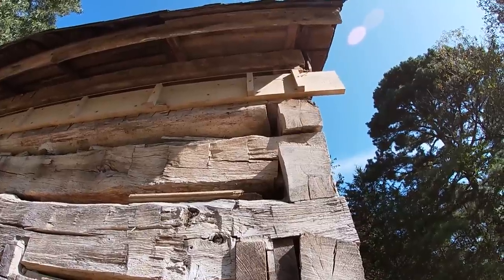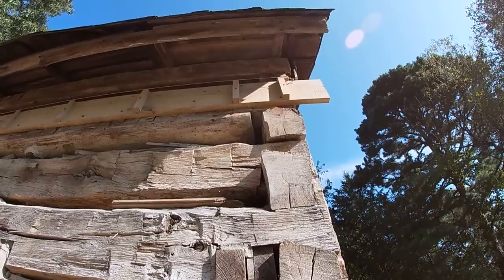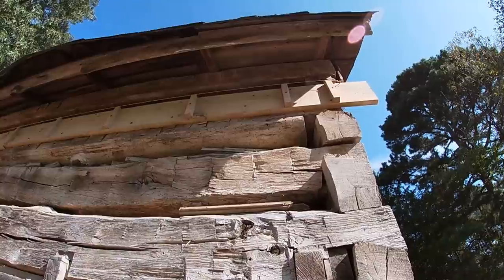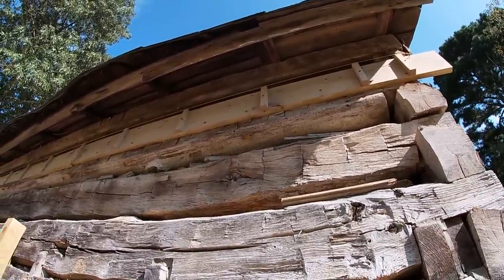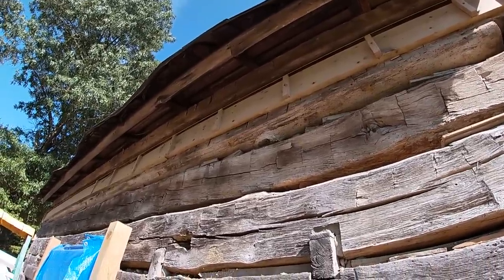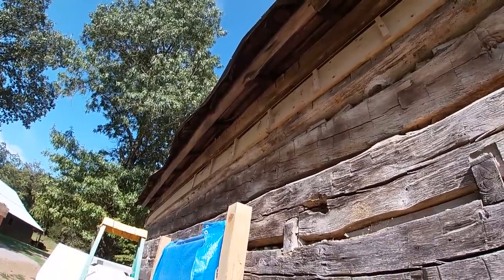After I got both ends established, that first block there on the end is plumb down to the white chalk line and set back the appropriate distance. And I put a string up there. I also have a block like that on the other end, and I put a string on it, and I measured off the string to the ribbon that's on the wall, the 1x6 oak, and I used a torpedo level to plumb and check what I needed to do. And so every one of these is on a taper, and this log was pretty badly twisted, so tapers are all different down through there, but I've got the thing pretty much lined up. I've got a few more to put on, and then I can put another 1x6 over the top of these that'll actually attach the peak of the rafters to.